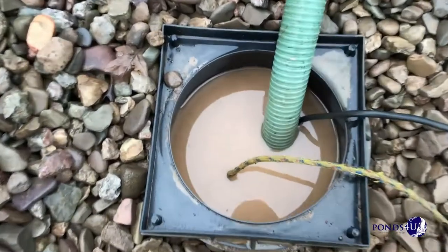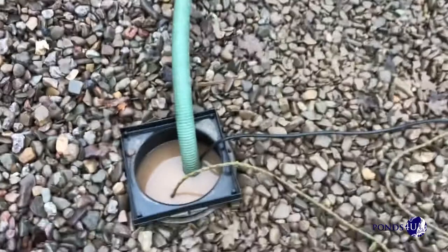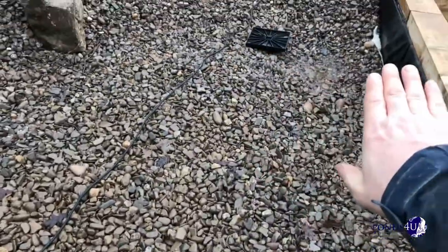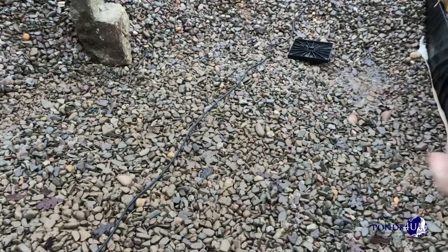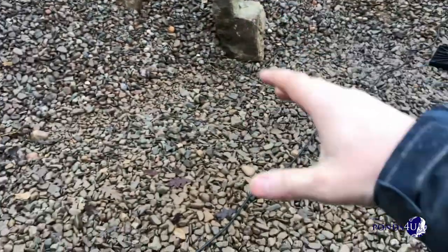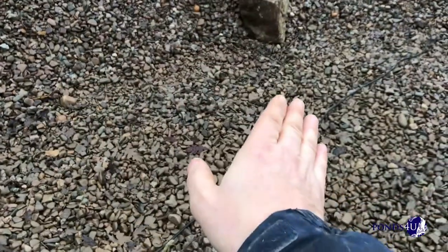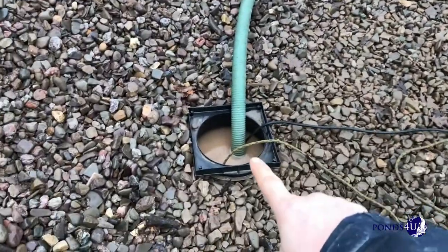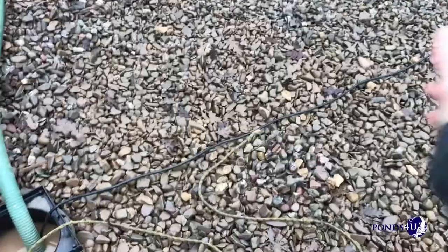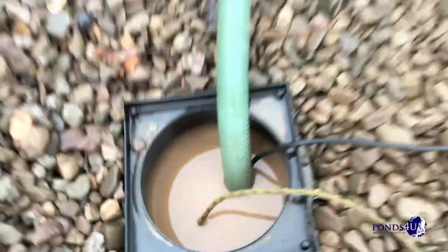Where it's driving it up through the pipe, it's coming up nice and dirty, so it's getting all the dirt off the bottom. We've actually chamfered this filtered area down and then cemented along the side of the pipe, so when you hose this down now using this cleaner right here, it naturally falls into the pipe — and the pipe is leaning to this chamber, so it naturally falls in here. Without dismantling it all, you can wash and clean it all through. You can see the sediment coming up — that's how dirty the stones were underneath.